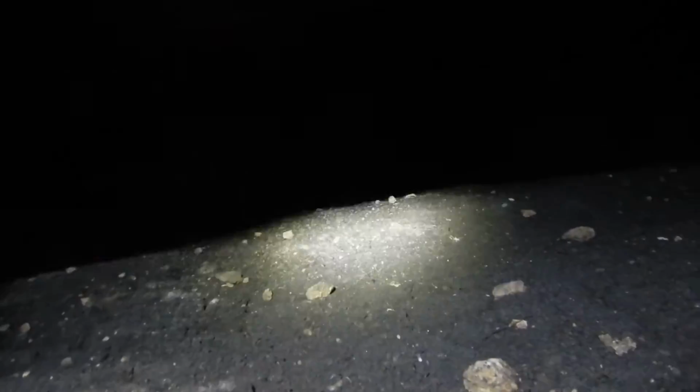That scraping you hear is my rear hitting the floor joists. Plumbing coming up out of the ground to the water heater should have been insulated. Plenum is on the ground. You're not going to be able to raise the plenum, so that should be excavated, lined with gravel. If it fills with water, then you need a sump pump, but the plenum's not supposed to be on the ground.